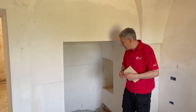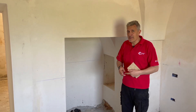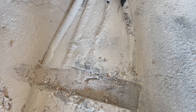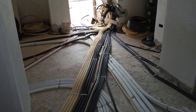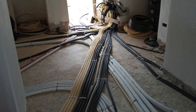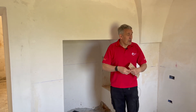One thing you won't need very often as an electrician in Italy is your ladders, because most of the electrical installation during first fix takes place in the floor beneath this screed. Here we've got all of the conduits running the distribution across the entire property, along with the plumber's pipework — so there's still that battle about who gets there first and who gets the prime location. You only really need ladders for things going up high, which in this type of property is usually light fittings.